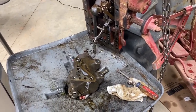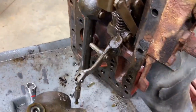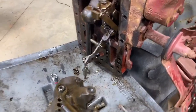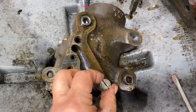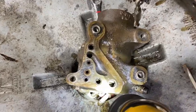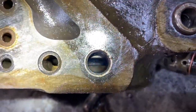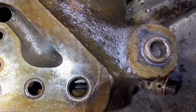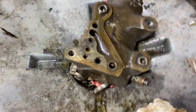I got it apart. As I mentioned, I could have left those fine thread bolts in place — that would have held it together as a unit and I could have taken it off as one piece. I think that's the reason for them having fine thread. I took this pressure valve right here — it was screwed in here. I took that valve out before I ever took this apart, wondering if that was the top of the piston down in there. And sure enough, once I got this apart and could see the piston in here, I confirmed that is indeed the top of the piston.